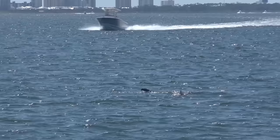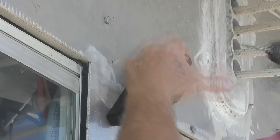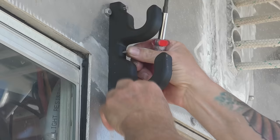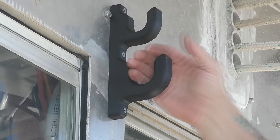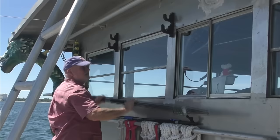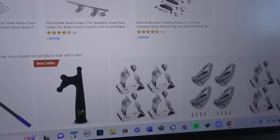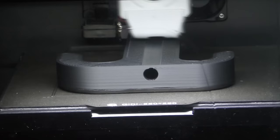All I did was tap the pilot house for a number 10-32 screw. I want these sturdy because I can just see somebody reaching up and grabbing the boat hook and holding on. Nice - I like it. Quick accounting: a spool of PLA is about $14 with around 330 meters of filament. I use about 80 meters to make one part - that comes to $3.40, so $6.80 for the pair. Typical boat hook hangers on Amazon run $9 to $20 for just one boat hook. So it's great getting something custom for less than the cost of something off the shelf.